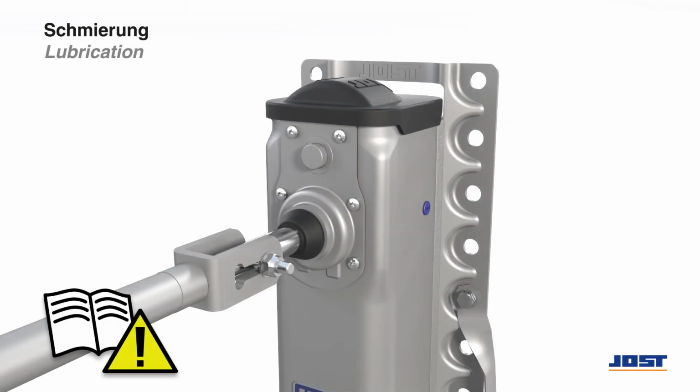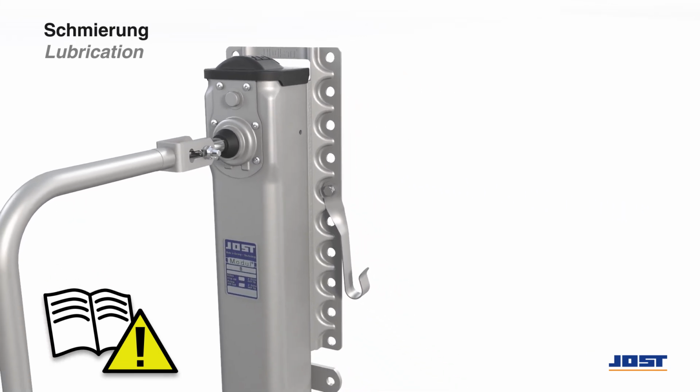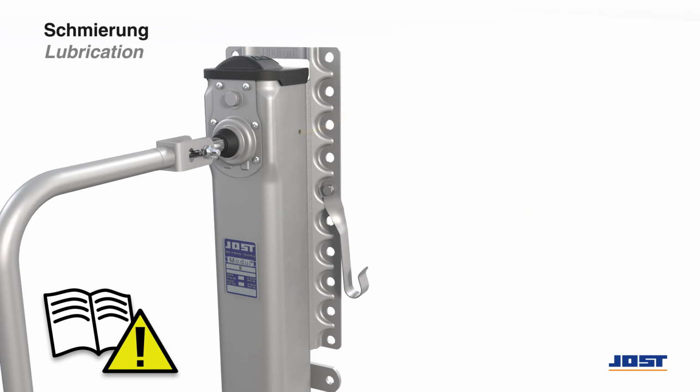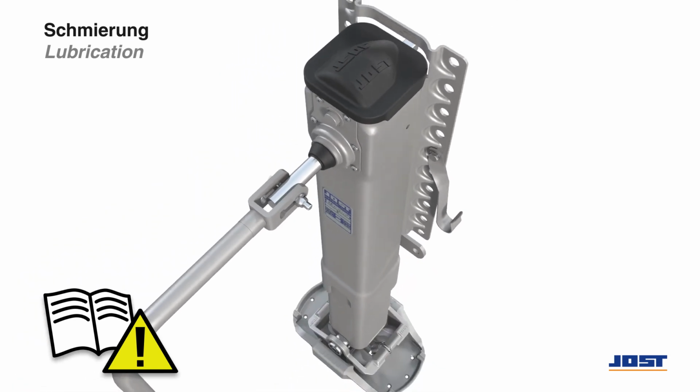The spindle has to be lubricated for the first time after 3 years. Subsequently, lubrication has to be carried out annually. For this purpose, wind down the landing gear to its limit of travel, open the sealing plug, fill the grease recess with approximately 200 grams of special grease.